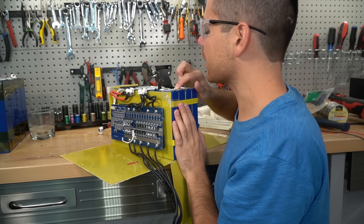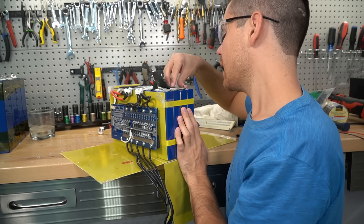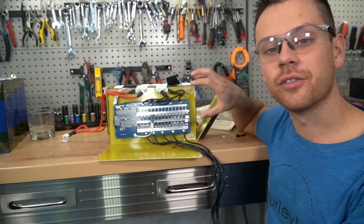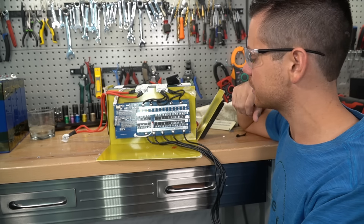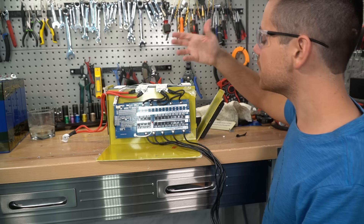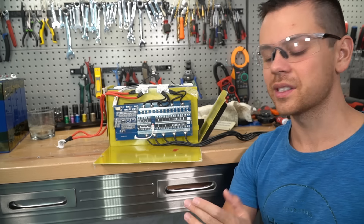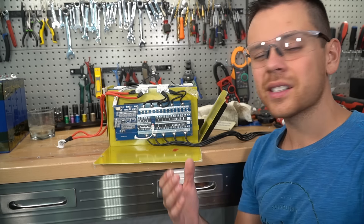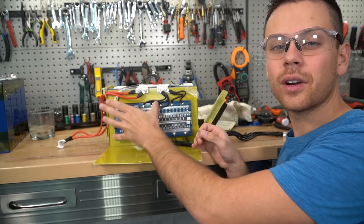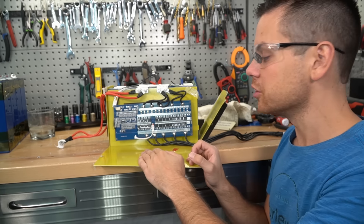This is probably the best cheap 12 volt battery we've ever tested. You'll notice we have four bleed-off resistors for balancing, but this board could be configured to have more — so you could have a 24 volt pack, and you can add more integrated circuits and components. So this is like a multi-use PCB. I've been trying to find a budget battery with all these features for ages and this is the first one. I ignored this battery because it had the same case as the others, but I'm glad I finally bought it. We should keep an eye on this company because if they're building this battery, they might be building other batteries that are good.